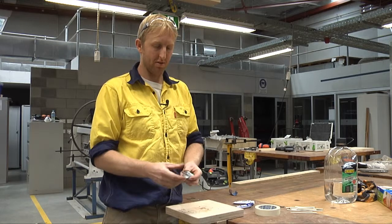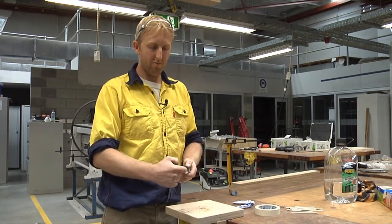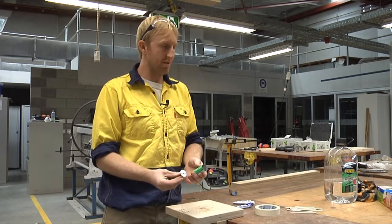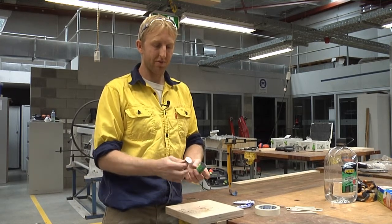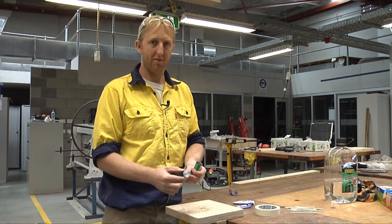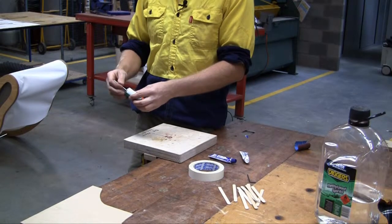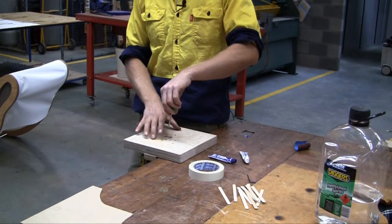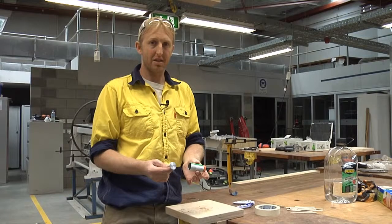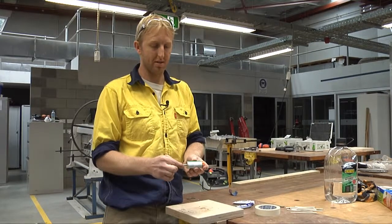So that will now fit in like so. The first thing we're going to do is actually rough up the inside of that with a piece of sandpaper. Because when you use an epoxy joint it likes to have a rough surface. We're going to gently rub the sandpaper around there as well to rough it up. Then we're going to clean it and mix up the epoxy and push them together and use this jig here to make sure it's all square. If this part of the engine isn't actually square the engine won't ever run — it'll bind on the displacer.